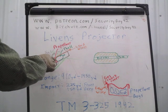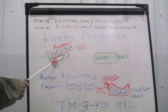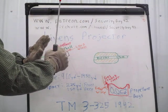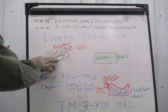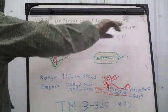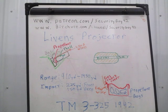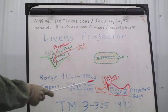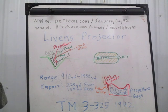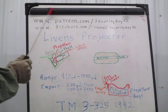The bottom casing of the propellant charge, when the bags go off, will deform and collapse inward a bit so you'll be able to pull it out. The gas check gets propelled up and out. The minimum range for one of these projectors is 910 yards with the four-ounce charge, to a maximum according to the U.S. Army of 1,450 yards — but the British Army said they were able to get theirs out to a maximum of 1,800 yards. Why the difference, I don't know — maybe it's the grade of propellant.